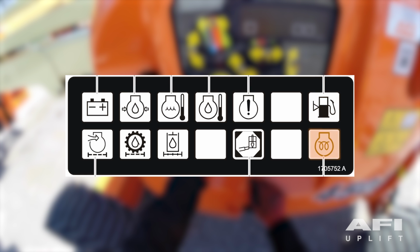Glow plug wait indicator. When illuminated, this indicates the glow plugs are on. The glow plugs are automatically turned on with the ignition circuit and remain on for approximately 7 seconds. Start the engine only after the light goes out. Overload indicator, if equipped. This will indicate that the platform has been overloaded.